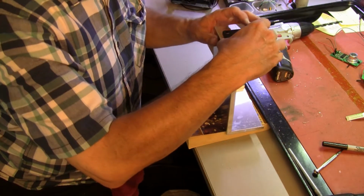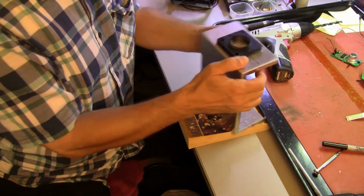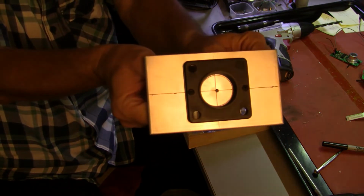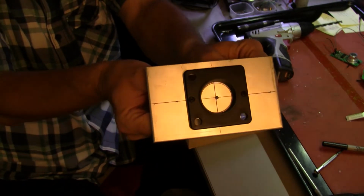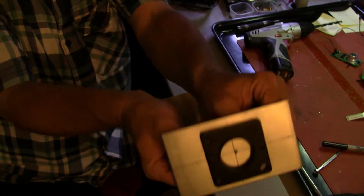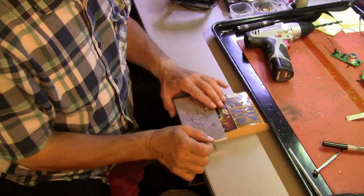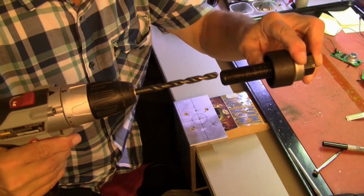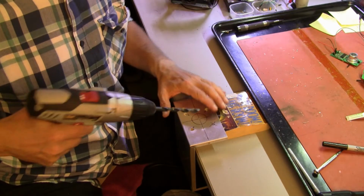Where's that thing? There it is. Alrighty. So the 3 openings for the pots are drilled through, and now we'll use this bit to do a medium size hole for the center, because we're going to have to work our way up. You can't drill a giant hole right away through sheet metal. This stuff's too thin. Alright, so since we have this medium sized bit put in here, you can see that compared to the bolt that we're going to use, this is about half the diameter. So we're going to drill this a couple of 3 times to get there.